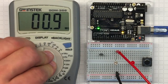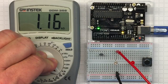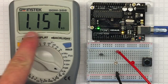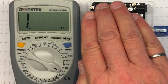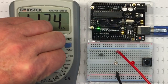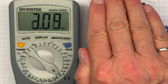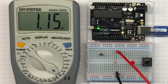Let's switch to a scale we can understand. I'm on the 20 kilohm scale, then I'll go to the 2 kilohm scale and I get about 1.1 kilohms — that's 1,157 ohms. And if it gets darker, the resistance goes up off scale, so I'll need a larger scale. I'm going from about 1,000 ohms up to about 3,000 ohms in the shade, or about 5,000 ohms if I cover it with my finger.